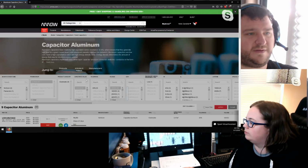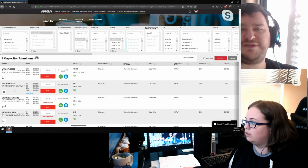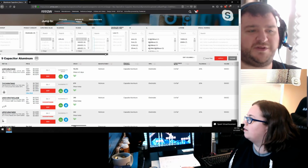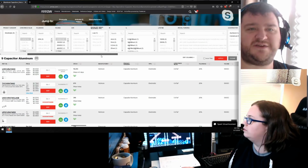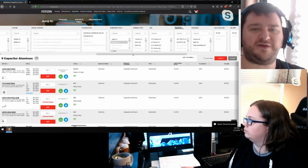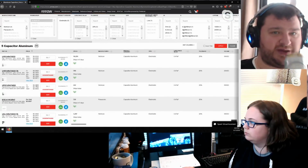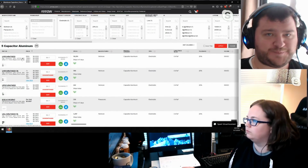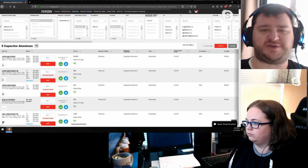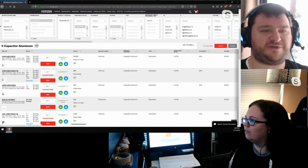So, would you prefer Nichicon over everything? If there's a choice of a better grade one, I would always happily pay for it because I just don't want to do this twice. And with stuff that you only turn on when you use it, you might not ever have to do this again for the rest of your life. But even if you have arcade machines that you power on every day, you might end up having to do this every 5-10 years, depending. Jose just had to recap a chassis at one of the Neo Geo cabs, and he just did it a few years ago. But they're on 7 days a week, and they're played by all the pro players that go over there.